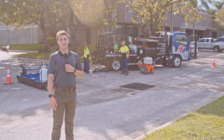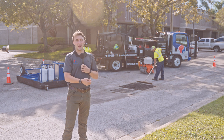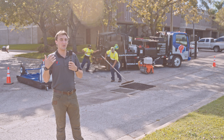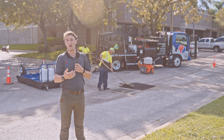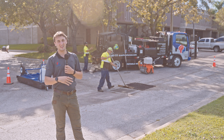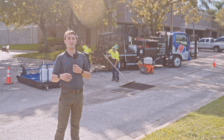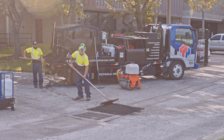The old asphalt trick — if you've been on a paving crew, you've seen it — the guys are just dropping the load of asphalt off the shovel real hard, dropping the bottom out from it. We want to keep our asphalt in a pile so we don't over-rake. The more you rake, you push those fines through and pull up the bigger aggregate, which you don't want on top — it'll give a bad aesthetic look and potentially cause raveling. So we put a big pile there.